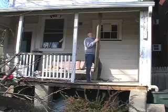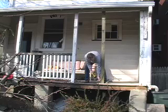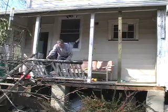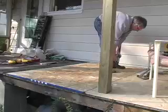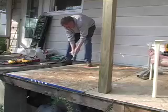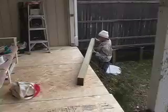Coming up is how I enclose the porch itself. I put this post in place because I'm going to take the other posts out and you don't want the whole thing to fall down, so you need some support posts. The reason is the old posts are not in the position I need them. Let's remove the railing and get rid of it — the old post we'll reuse but right now it's not where I need it to be. Now I'm going to put some new floor in there just to reinforce it and seal it up, because I don't want air coming in from outside. I used tongue and groove flakeboard and put it down with drywall screws over the old floor. There it is complete, ready to accept some styrofoam later on — but right now let's put this three by six in place. I'm using that as my base plate for the glass.